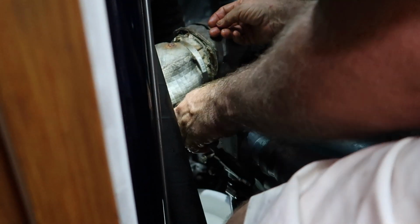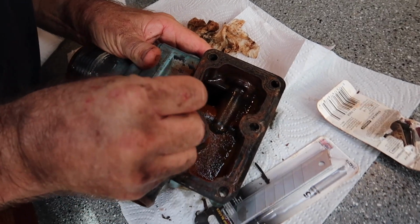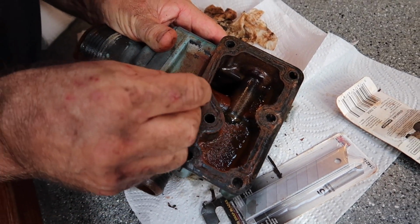Two days before we had a Britican experience, I did an engine check and I noticed there was a leak coming from a thermostat housing, and I thought, oh, there's no way I can get the parts in to St Martin. I rang round, no one had these parts. My friend Tim came over and helped us, and we took off the housing. We noticed that the O-ring inside had deteriorated, so we got some gasket material and made a gasket for it. So keep watching and see how easy it is to make one for yourself.